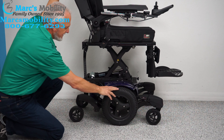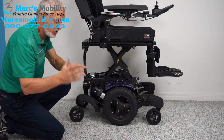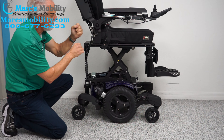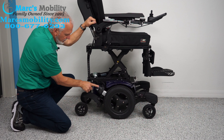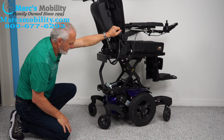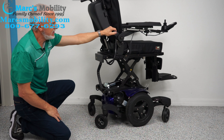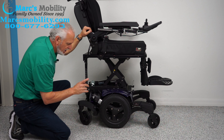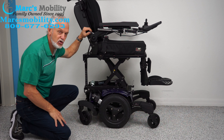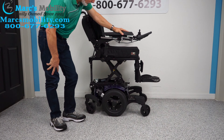If I want to push this chair right now, you can see we're in gear — we're not going anywhere. So if you ever want to push the chair because you have an issue, just turn the power off. You want no resistance in these motors. Power off, and right on your motor you'll see a little handle right here — push it down and that unlocks your wheel. You have one for each side. Put them both in neutral and then you can roll the chair. When you're done, do not forget to put it back in gear, because if you don't, everything's going to light up and you won't be able to go anywhere. So you're back in gear, turn your power back on, and we're back in business.